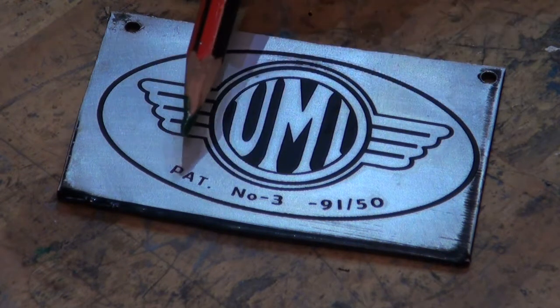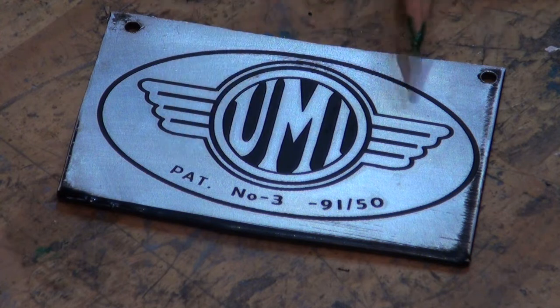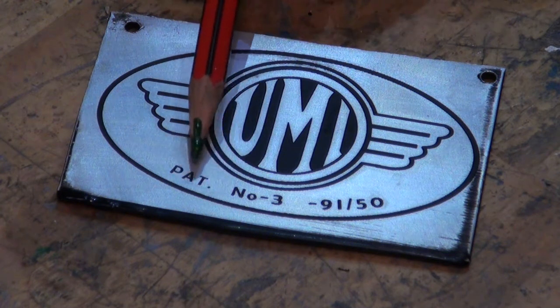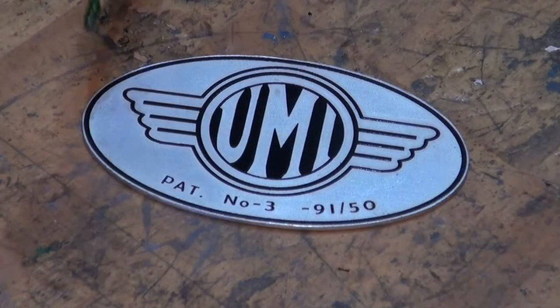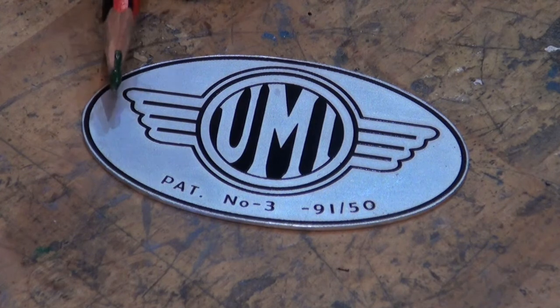I may keep this one because the lettering is pretty good. Sometimes the laser engraver needs to be run over that surface twice to remove more of the powder coat, and that in turn makes some areas a bit thinner and narrower. I think this one's good enough — I might just mechanically remove some of that remaining powder coat and use this one. I'll drill a pair of holes at the corners and attach this to the original tray using hollow rivets.